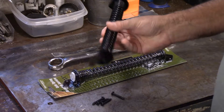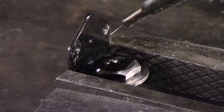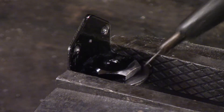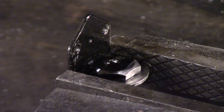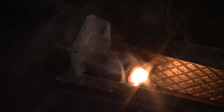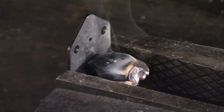Let's start doing some welding. There's the spot — you can see I've bared it all here. I did have to bare the backside just to get a ground for my ground clamp. I figure if we just put a tack right here that'll be good enough — a lot better than what it was. Okay, there we go — let's get on to the top side and see what I'm going to do there.